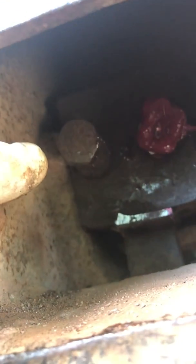I loosened the track with that nut there, just about one turn around. I've seen the idler move and the track collapse. Then I sawed this plate off because there was no way I could get the fitting out without getting this plate out of the way.